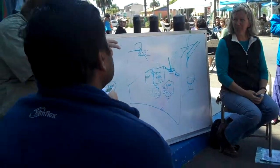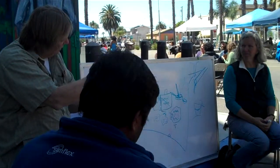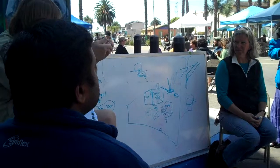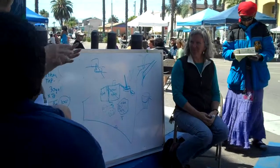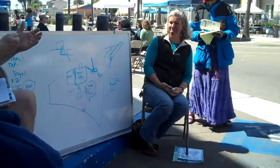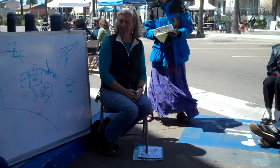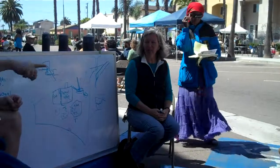Shower and bathtub. I'd have to get under the house and find the pipes where they come out, and they might be like old cast iron or something like this. And then to saw them loose, then you'd need collar couplings and Ys and no hub fittings. Big valve to make sure that you could switch it back to the sewer. Yeah. Because things are gonna jam up eventually. Yeah, if you use it. Yeah, you'd want to have a clean out.